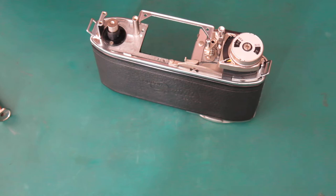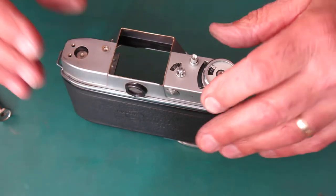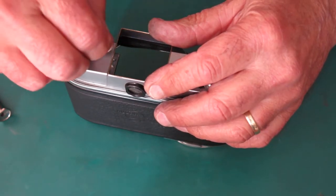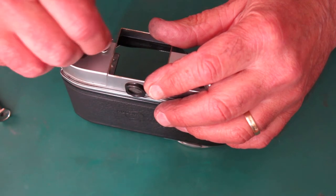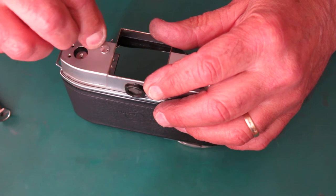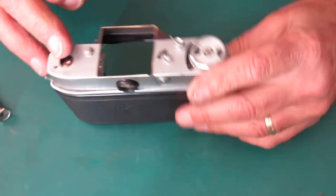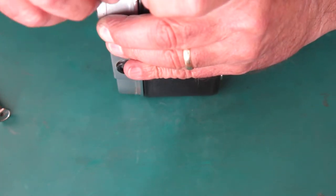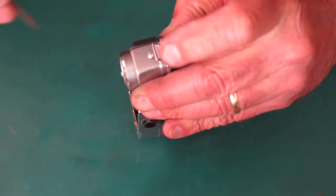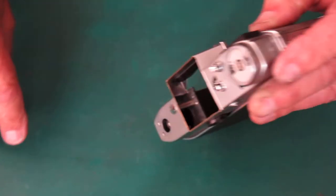I'll pop the top in my test top cover in place to keep the meter from falling off. If I sound like I'm a little bit paranoid about meters falling off the top of the camera, it's with good reason. As soon as your back's turned, the meter will fall out of place, the tension will be lost on the cord, and as a result, the cord will come off the pulleys, and you have to go through the whole tedious business of putting everything back.